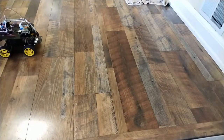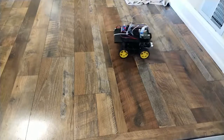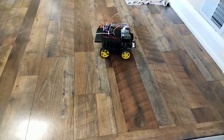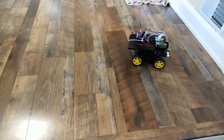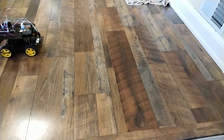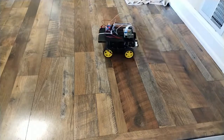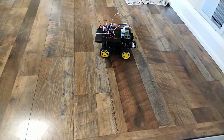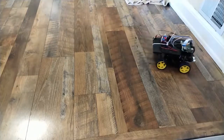Next I tried using the ultrasonic sensor. In this video the robot drives until it sees a wall within 10 inches, then backs up for a somewhat random amount of time and tries again. This test was difficult because the ultrasonic sensor does not always receive a response, meaning sometimes the program doesn't measure an actual distance. I account for this by assuming the distance is large and returning a value of 1,000 inches in that scenario.